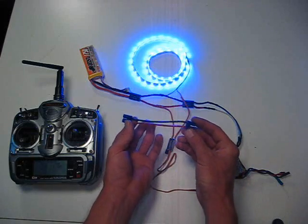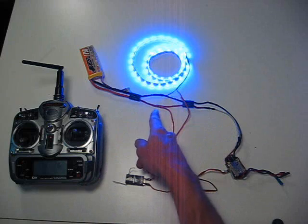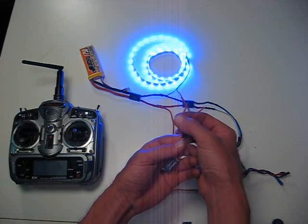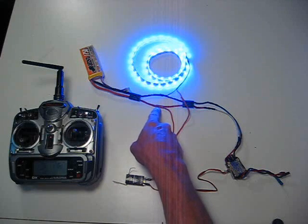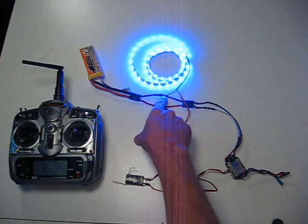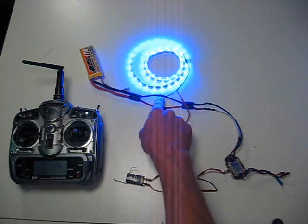What I've done is I've taken this four-inch extension, and what I've done is I've snipped the positive lead, and I've taken one of the wires — it doesn't matter which one, you can take either one — and I've wired it in and then soldered it in, put a little bit of shrink wrap on there. And then on the negative side, I've patched in the negative on these LEDs and then shrink wrapped it.